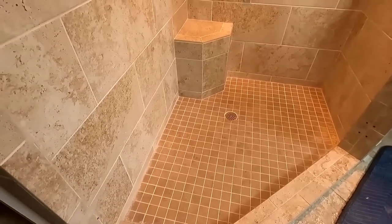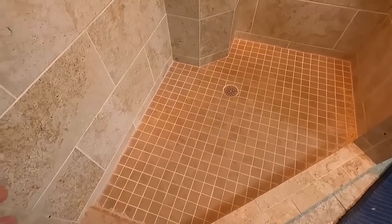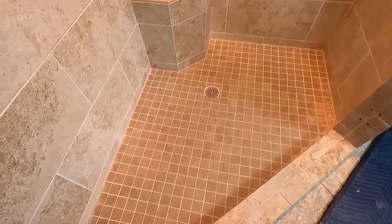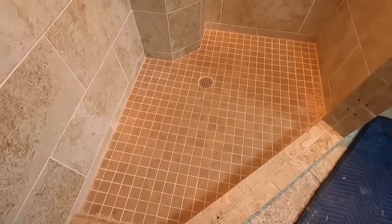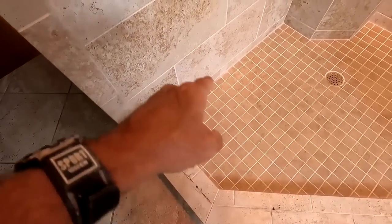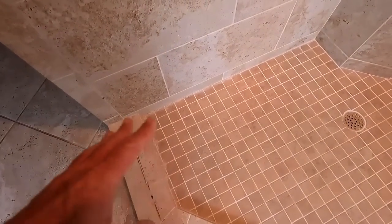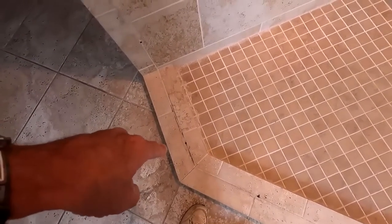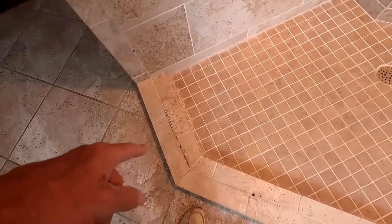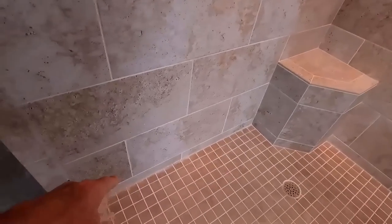It is downstairs somewhere. Downstairs is an open basement concept. There's nothing, you can see everything. So it's very evident that this whole area around the drain, the plywood, the OSB as it were, is all dry. However, over in this area downstairs, there's a stain on the OSB. So my take on it is that it's coming somewhere from this area. It's very doubtful, as I said, the screw heads, because again, it's just caulked really, really well. And so I'm not suspecting that at all. The shower head is spraying over that direction and not over here.